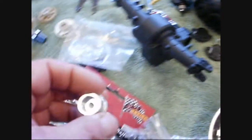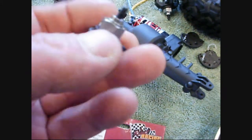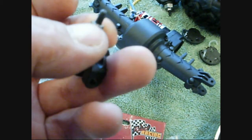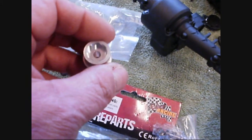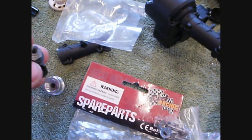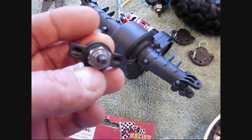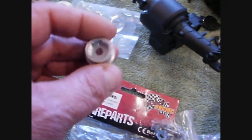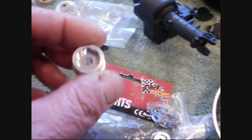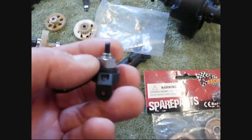There's no real way to drill that down — it's a hex shape. The issue is the stock hexes come with a little step. There are two ways to approach this: you take this off and grind it flat, or drill this out just a little bit so that the widener will fit in there. But it's a two-level step, and if I drill it out to the full size, I'm losing a lot of meat and metal-to-metal contact. I really think the way to approach this is to grind these down, so I'll be taking these off too.